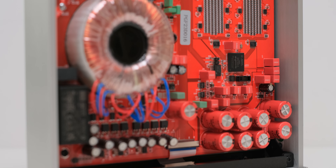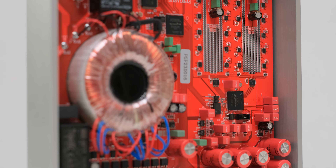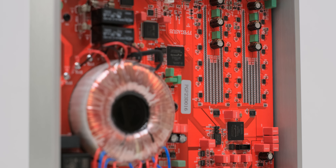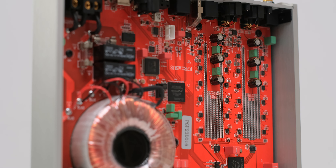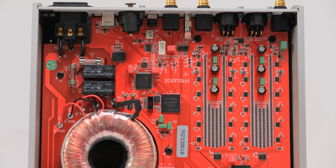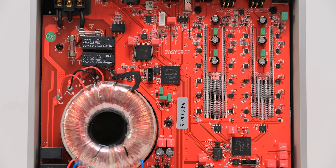The capacitance of electrolytics went up by 50%, which is always a good thing. Let me explain why in 2024 this will be a desirable DAC to have in a Head-Fi battle station, but also in a stereo setup. For starters, we have the highest precision 0.05% resistors forming two stereo ladders. If that's correct, then the Pegasus 2 again competes with pricier R2R ladder DACs. There's no preamp stage or volume control, so the signal path is shorter — if you own a power amplifier, you'll need a preamplifier to control the volume.